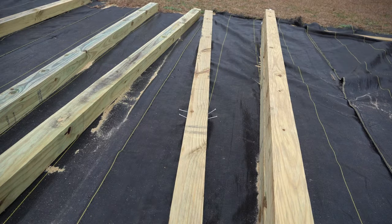When it comes to concrete, I'm going to be only encasing the top 12 inches of my posts in concrete. Some people, depending on their soil, choose not to use any concrete at all and just backfill very tightly in lifts. The best thing to do is to encase the entire post in concrete, but I'm not buying 5 bags of concrete to encase this post 3 feet deep. It's total overkill.